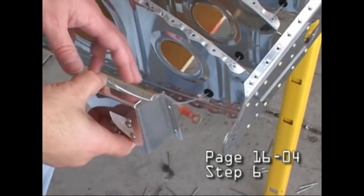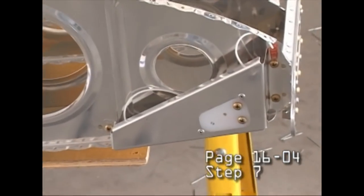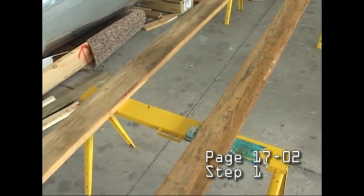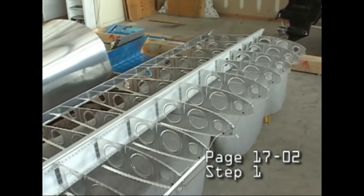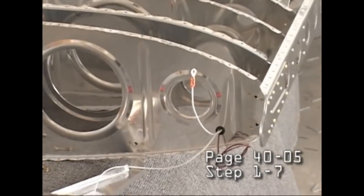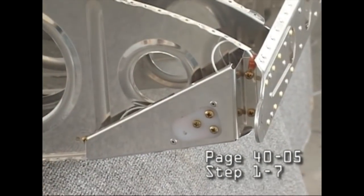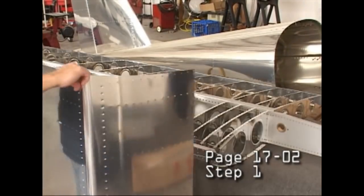Also keep in mind that when you have a removable wing like this, and that wing has some electrical connections, for example, for the light, for the stall warning sensor, we need a method to connect and disconnect the wires when the wing is removed and attached. And that's what some of that wiring was all about. And that will come up again as we watch. And that device there is going to mate with the side of the fuselage to make the electrical connections for the lights and the stall warning sensor.